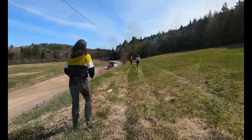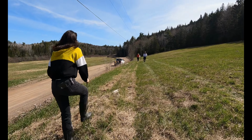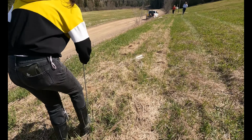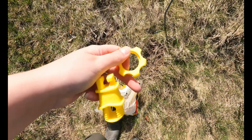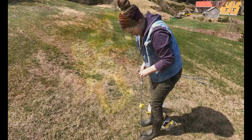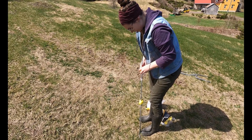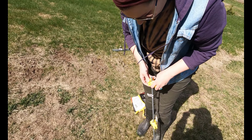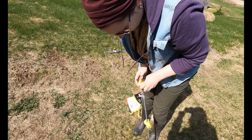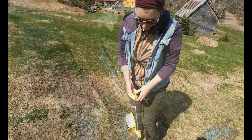Meanwhile, step-in stakes are placed between the wooden posts in a straight line about 8 paces apart. Onto these we screw the plastic insulators, which will hold the wire in place as it runs along the perimeter. Our rule of thumb is to put one about knee height and the other as near to the top of the stake as possible, making sure to twist them nice and tight.